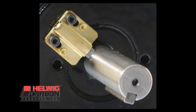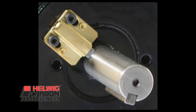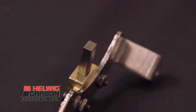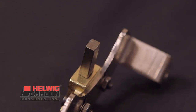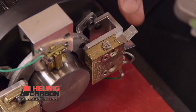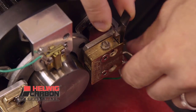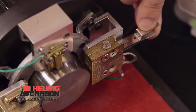They can be installed internally or externally. Virtually everyone who has a motor connected to a VFD is a candidate for the bearing protector. The silver graphite brush not only lays down a film, it also cleans the shaft surface assuring ideal operating conditions even in contaminated environments. The design of our solution has a constant force spring which keeps consistent pressure applied to the brush allowing it to maintain continual contact.